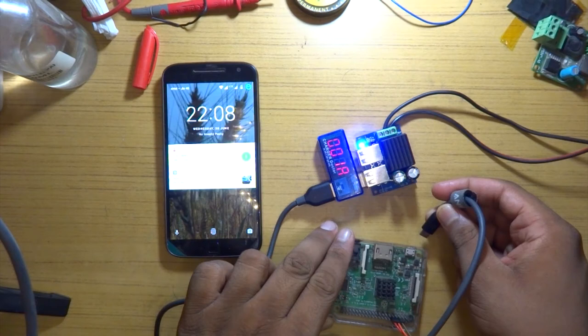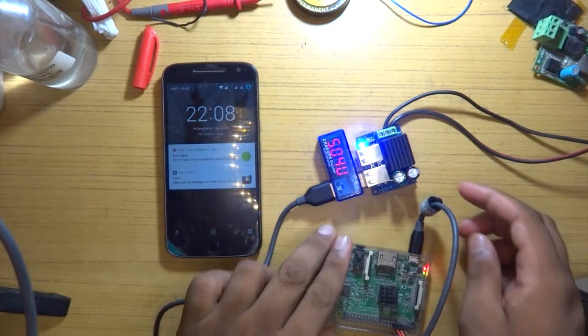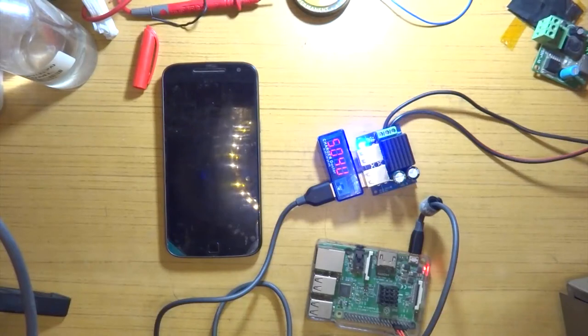The Raspberry Pi 3 takes a pretty good amount of current while booting up, so let's see if it gets any load. On the Raspberry Pi side of things it doesn't seem to have any issues — it's drawing around 0.3 to 0.4 amps at the boot stage and it seems to have booted up pretty nicely. Running a Raspberry Pi off of this should not be an issue.